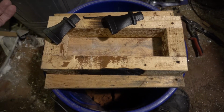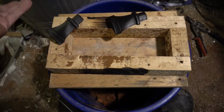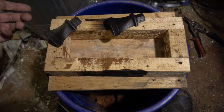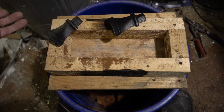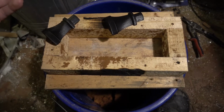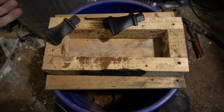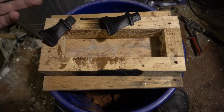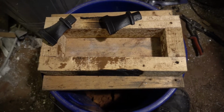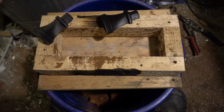Also, copper and aluminium are easy to get, so an aluminium-bronze is probably one of the more available material compositions, and it's quite usable for different things. Depends, of course, how you tune it. And then next time I will go into a more complex alloy, where I also add other things. It will be a 7-component alloy, I think. Yeah, if I get it right. And quite an interesting one too, because you can add all kinds of things to copper. Things like nickel, silver, antimony, phosphorus, or iron. You can add iron to copper.